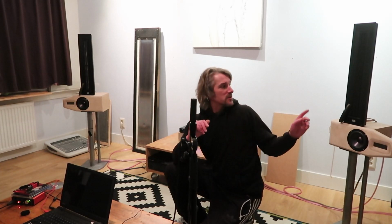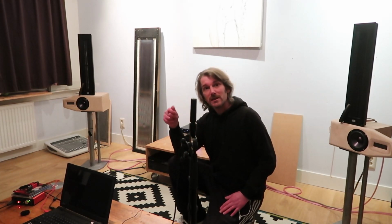Resonance is around 280 hertz, 300, somewhere in that region. It's funny that you can see that width mainly determines the resonance. So both are exactly the same. Even if you had slightly more tension in the vertical direction, the resonance is exactly the same. So that's funny.